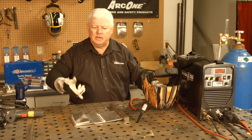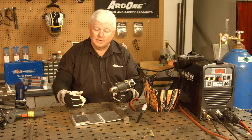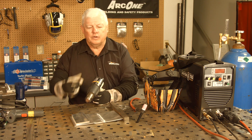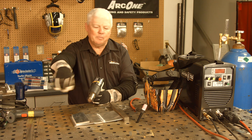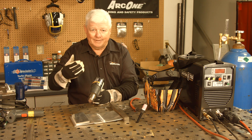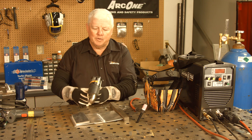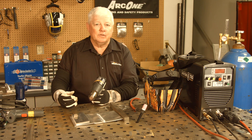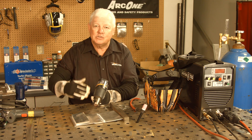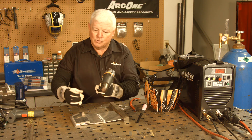So I'm going to take my heater and put it in place. It's just a paint stripper — you can get this at Home Depot, Lowe's, any of those places, for between 15 and 20 bucks. Put it on there, hold it on there, let it saturate, and walk away. What's going to happen is you need to bring this material up to about 125 to 130 degrees minimum. If you have an oxy-acetylene rig, go ahead and use it because it's immediate — you can get things preheated pretty quick. I'm just going to leave it on for probably 10 or 15 minutes, then come back and weld this thick material, just to show you that by raising your temperature 50 to 100 degrees, it makes welding aluminum a lot easier.